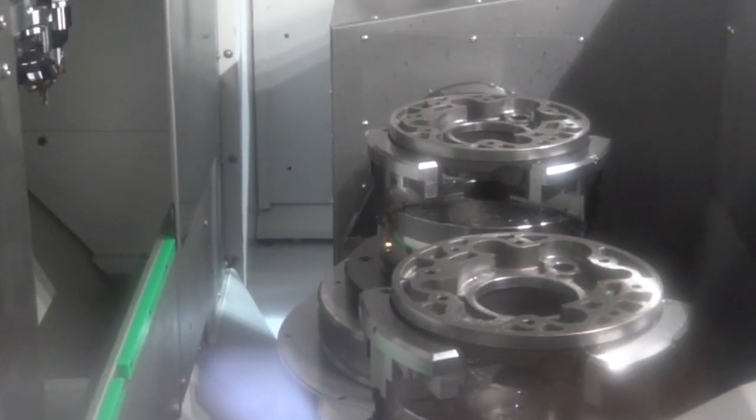It's standard on the 338. Our machine series 3 starts with the 31 and ends with the 38, which is just a change of the dimension on the work area and the strength of the motor spindles. And when I said power and speed — how much power have you got? We have 65 KW on the milling spindles, so it's very strong.